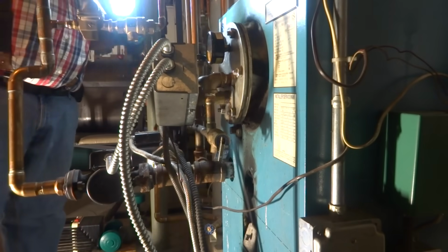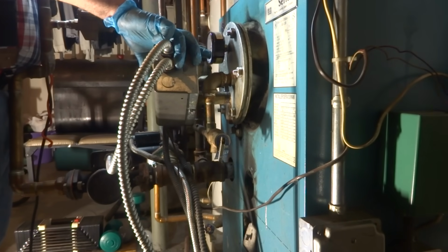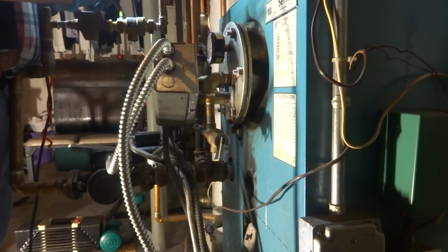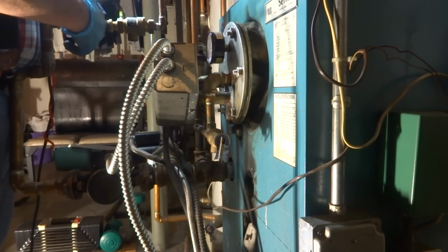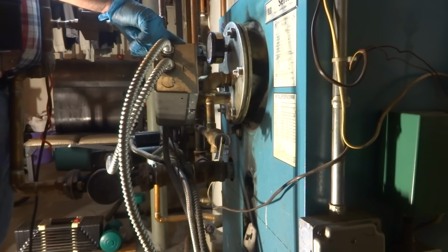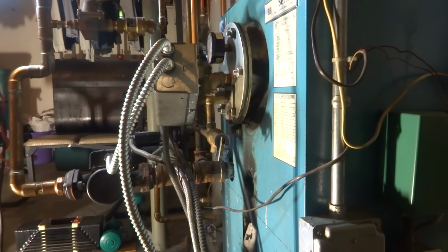Unfortunately. Yeah, I had turned zone 2 on up. No, that's got nothing to do with it. Okay, just wanted to make sure you knew. When I came here, there was zero pressure in it. So what I did is I just flicked this up because this was stuck. This is the water feeder that keeps pressure in the boiler. And as soon as I put some pressure in the boiler, then that started dripping. Okay. Well, you got issues.